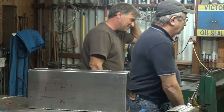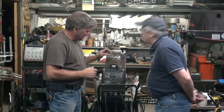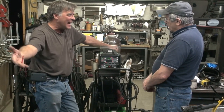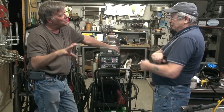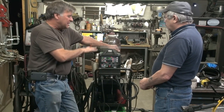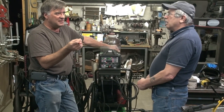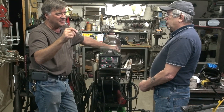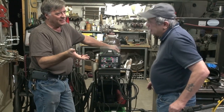Come on over to the machine, let me show you a couple of different ways to set them up. This is the Everlast Powertig 255 EMP, according to the sticker — one of their newer machines. For an eighth inch, I would run it up around 115 to about 135 amps. That's where the pulse would come in. If I had it set at 125 amps, it would be set at 50% of that 125 amps. The newer machines all seem to run on percentage. The older machines, you actually set the amperage itself. What they found was it's easier just to run everything on percentage — it makes it easier on the computer rather than doing all the different averages and levels. And then you just have to remember it's a percent of rather than an actual specific number.